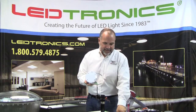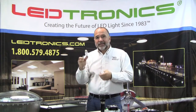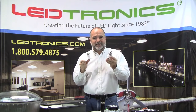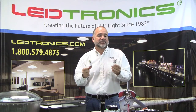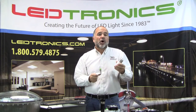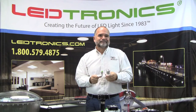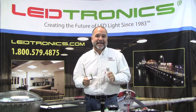This yoke is fully adjustable and can be mounted inside the fixture to any threaded boss inside. You can get either an E26 or an E39 base. These are dead sockets, so this is just a mounting access point. Makes things really easy if you're using it for a shoebox, a wall pack, a canopy, or a high bay. There are so many applications this unit can be used for — it's fantastic.